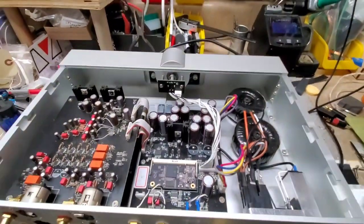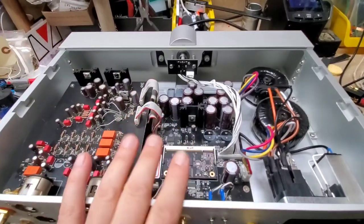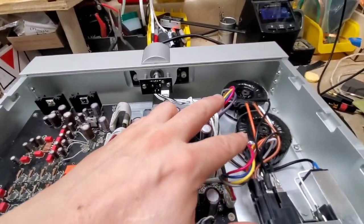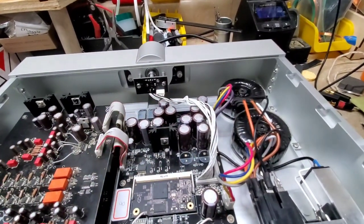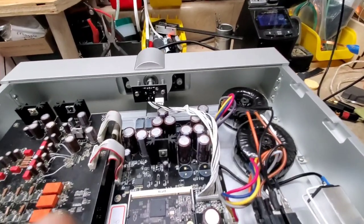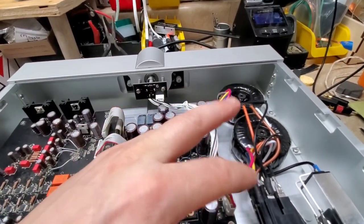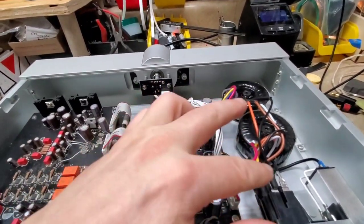Here's the inside. It's cool. I'm really tripping out on the way it looks more so than the inside, but I'll go through the inside with you. It's obviously analog and a digital power supply, so it's got two toroids — always a good sign. If you're really highfalutin, you've got three: one for the right analog, one for the left analog, and one for the digital.